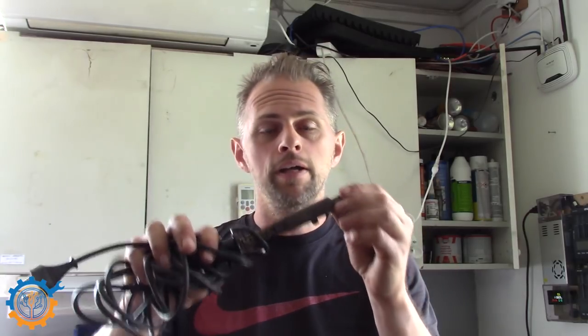On spot number 5 you need a soldering iron. I recommend something like this — one with a thicker tip and a big mass. This one is around 150 watts and it solders the cell quick and easy. You can check my other videos on how to solder and desolder and you will see how easy this is working.